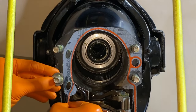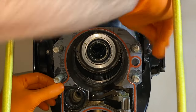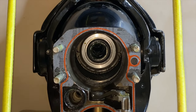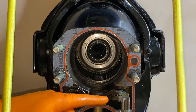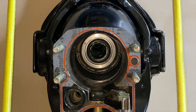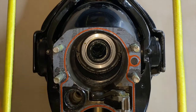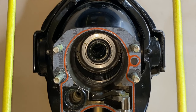Pulling this back out, I noticed a washer on the backside — I need to take that off, that's important. Back on, and all nuts and washers are accounted for. Now let's direct attention to the shift cable slide and the shift mechanism that guides the lower bushing and shaft. In a previous video, we lubricated this section, and it is going to be in constant movement as you shift from neutral to forward, back to neutral, onto reverse, and back to neutral — so you want this portion lubricated with 2-4C. The entire bell housing, O-rings, gasket, and lower shaft are properly prepped and ready for the out drive.